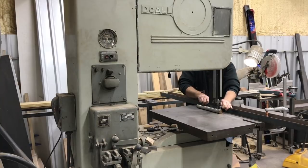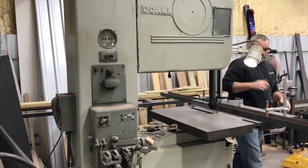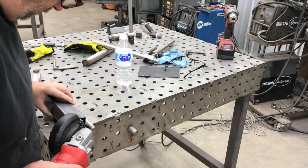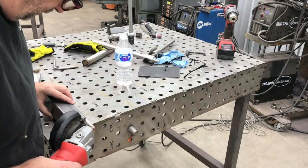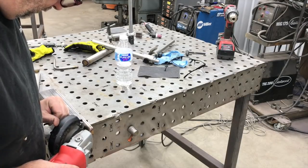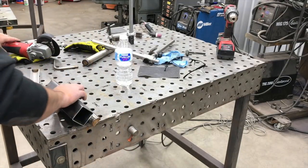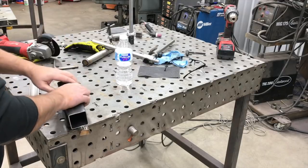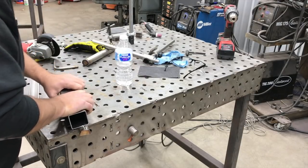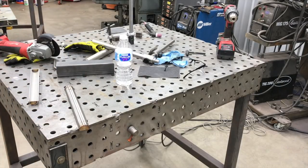Stainless — heat is really the main issue, and it's very hard to work with in terms of surface hardness. At the end, cutting through that center cap, I kind of had to work it back and forth a little so I wouldn't cut against that flat edge. Back over on the bench, I got a grinder cutting the tacks, trying to cut them without marring the surface of the round tube because it has a pretty nice brushed finish. I just cut down into the square tube and broke the tack loose, then rocked it back and forth to get it free.